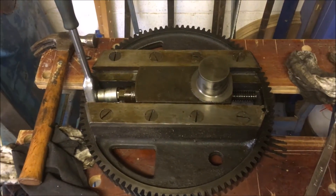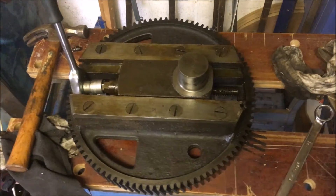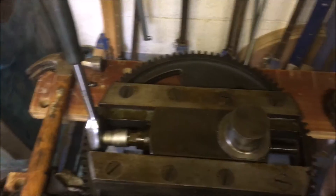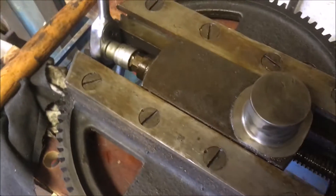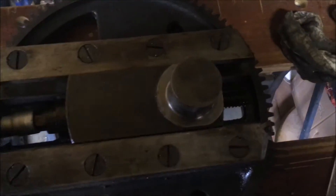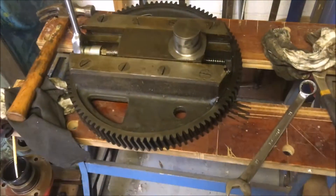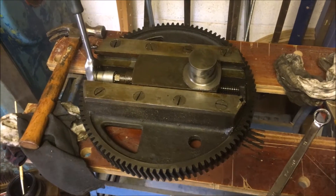I had several cups of tea, a lot of thinking, waiting for the last episode 5 update to upload, so I thought I'd lift the gear up and try to take this off — which meant removing the broken bit, which was the stop. I'm now just using a ratchet, very stiff, feels as if it's bent. Anyway, to wind the stroke length adjuster out, then once that's off, take a look and see what meat we've got to play with, then try and come up with some plan for repair.